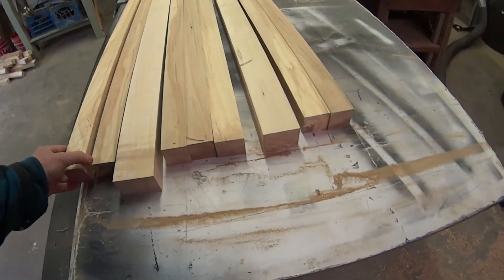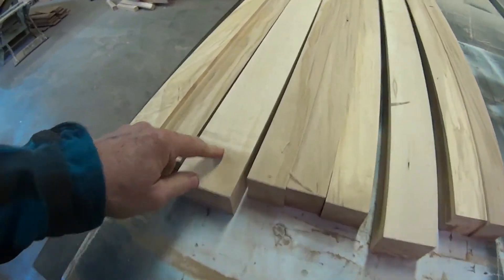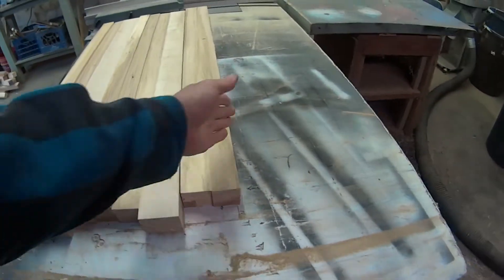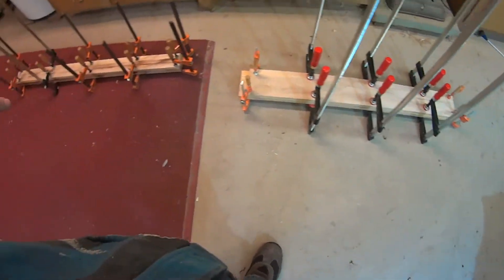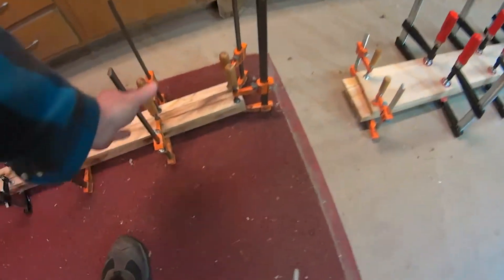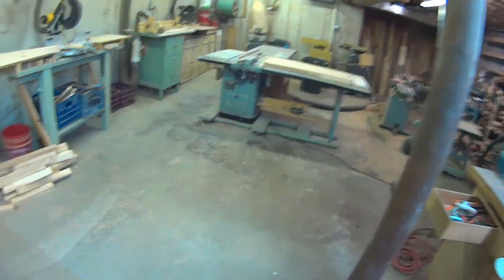I ran a little short when I brought this pile in last summer, so there are a couple of planks from the scrap pile that happened to be maple to make up enough for what I need. This one in particular is just a beautiful quarter sawn maple board. I still don't have quite enough for the 23 and three quarter inch width, so I've got a couple of pieces on the floor — just gluing up some scrap maple planks. One is a thin piece onto a thicker piece, but it'll be just fine. With those two added in I should have enough maple to finish this project.